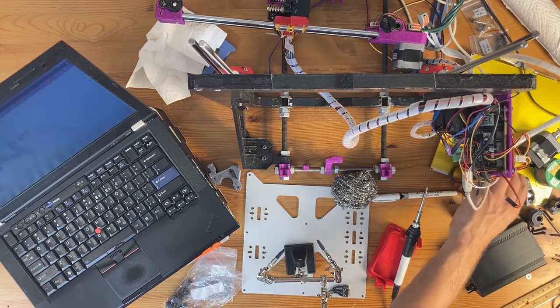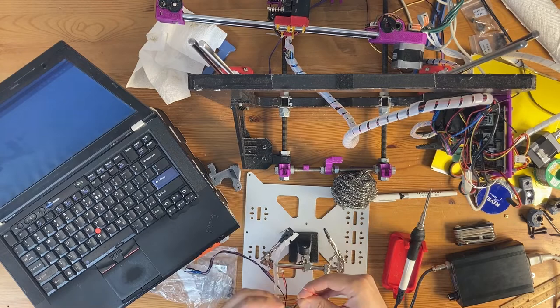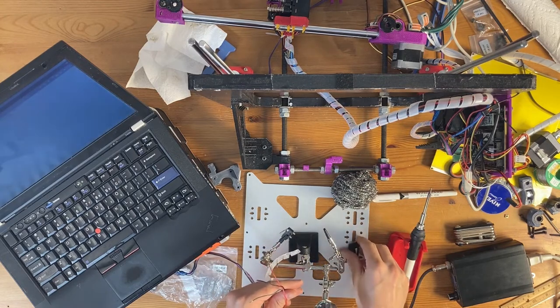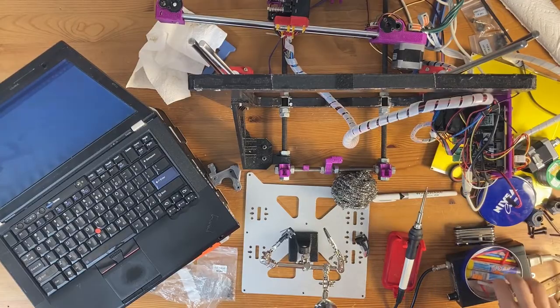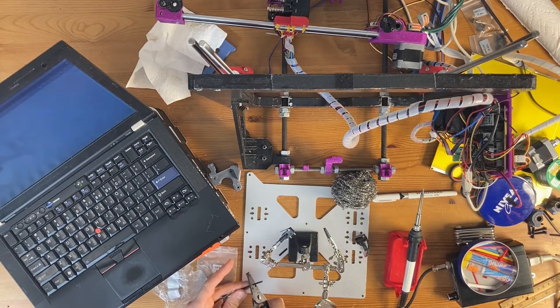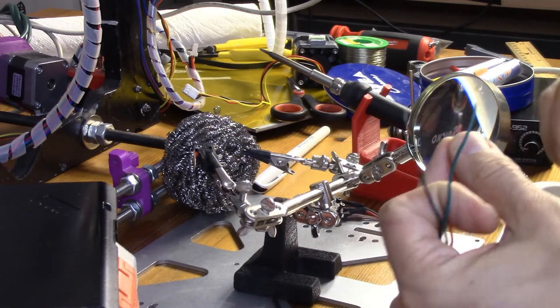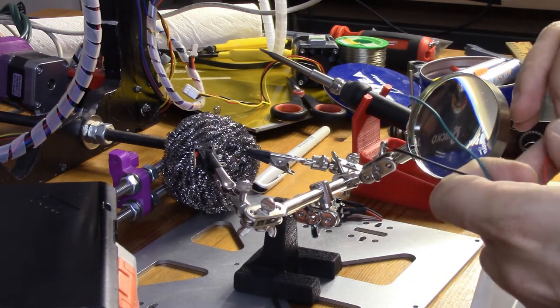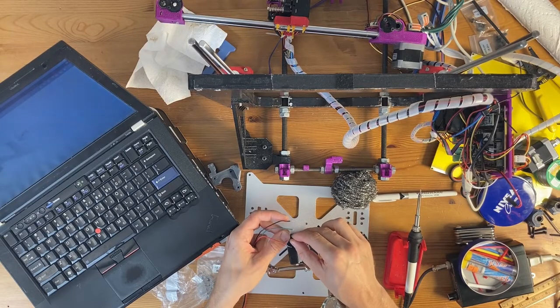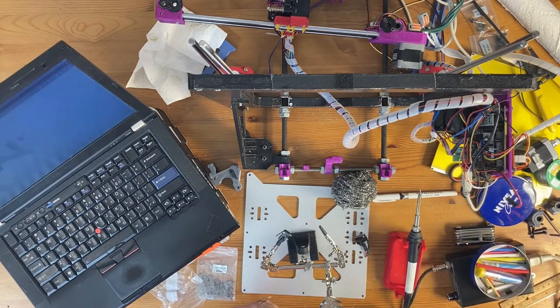And I'm just going to plug the power in, get the end switch so it goes like this, same orientation. I need my heat shrink. Cut the heat shrink, maybe with a cleaner cut. Put heat shrink on each wire. Let's see if. Oh, and I just got heat shrink for nothing because it's too small. Let's backtrack, find an appropriately sized heat shrink. Yep, that will go.